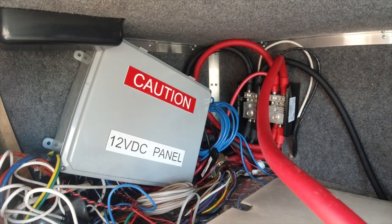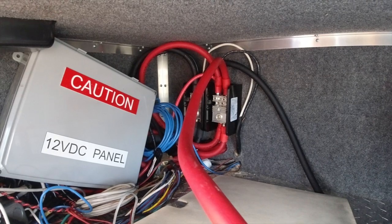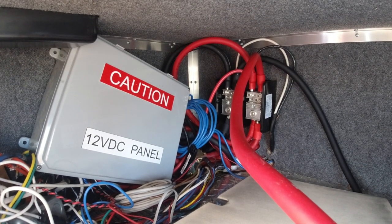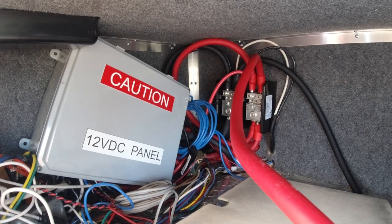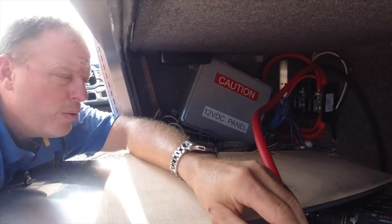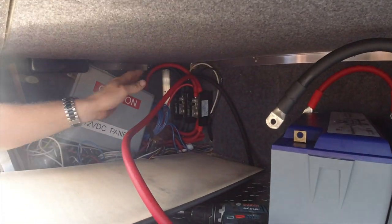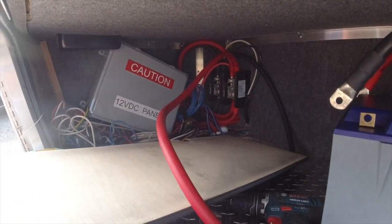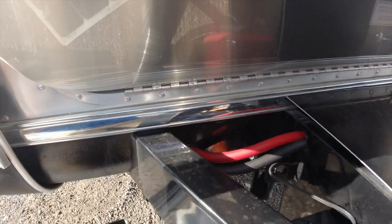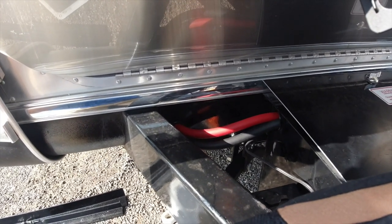I have a feeling the DC power side is all that's messed up, and the AC side is probably going to be perfect. I'm pretty sure an electrician did this install, but you have to know both AC and DC to do these systems — you can't just wing it. Everything was fairly protected; he does have a fuse on the system. But the fuse is over at the Multi Plus inside the RV. All of this — the battery bank going into the distribution block — runs under the RV into the box with the other two batteries, but those wires have no fuse protection on them.